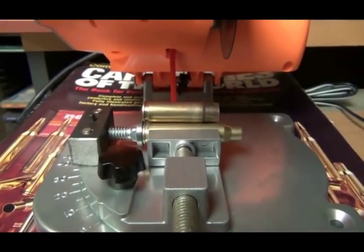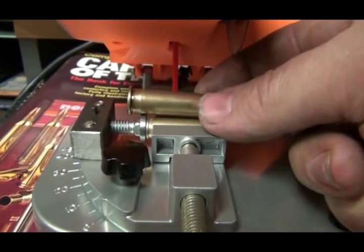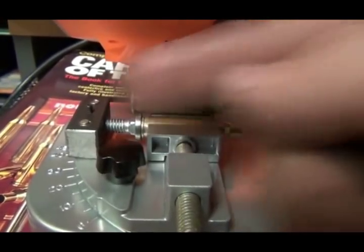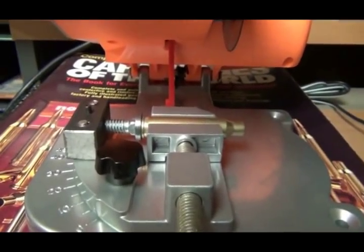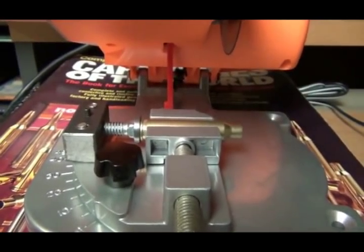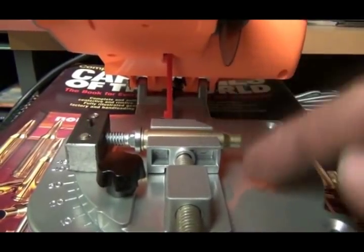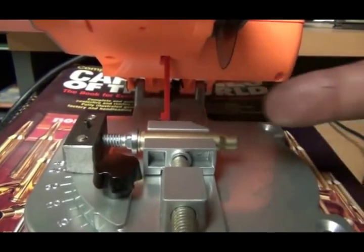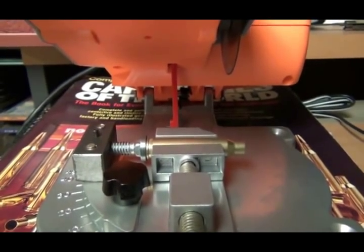Hope it gives you some ideas on how you can handle yours. This is the 30 Herrett brass, so I can back that up and lock it in place for when I need to cut off more of those — fully adjustable. The only trick is going to be making sure your brass is in there square. I may make a little wedge to put underneath it so you just set the brass down on top of the wedge and that'll have it squared up. We'll see if it's necessary. Thanks for watching.